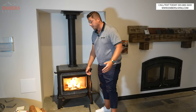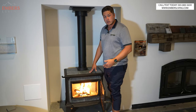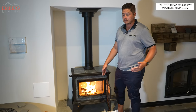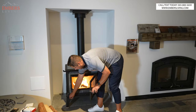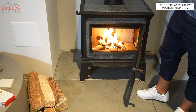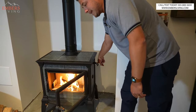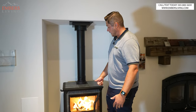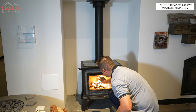So after that starts to warm up — by the way, each stove is going to be a little bit different. What we're going to want to do is if your stove is a newer stove that's pretty airtight, there's probably air controls on it. We want to open up the air controls as much as possible so when this fire is fresh it has as much oxygen as possible. That's also why I have the door open. Here's our air control on this particular stove, and I have that wide open. This also happens to be a catalytic stove, so our catalytic bypass is right here, and we're not going to engage that until we hit 500 degrees. If you have a catalytic stove, make sure that bypass is open so the fire can just escape right out.